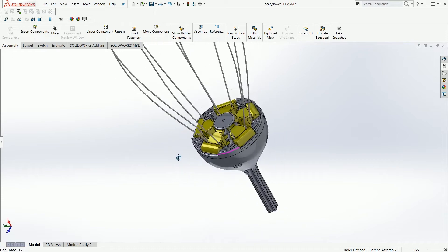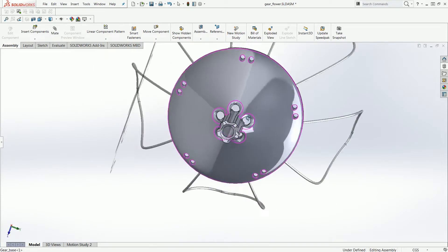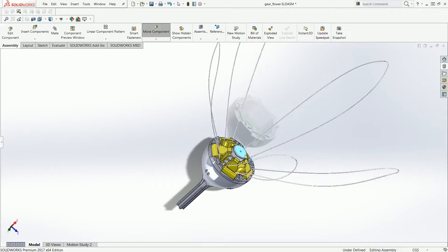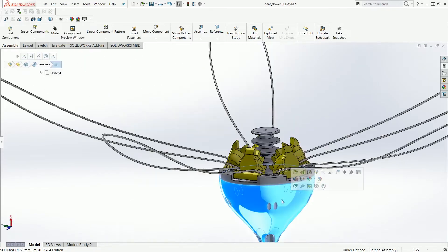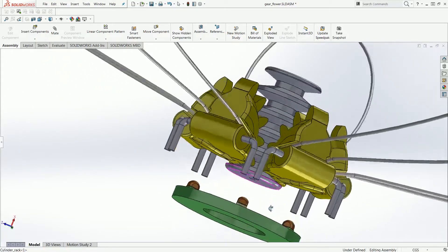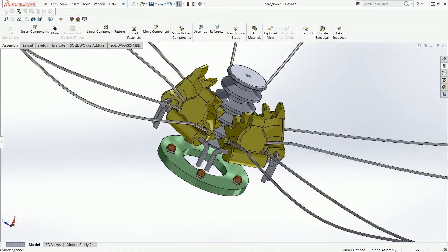The design language I chose for this project is 3D printing and simple wire forms. I wanted to be able to prototype it quickly and easily without spending a lot of money, yet have a design that could translate into volume production if we found a customer for these beautiful things. The 3D printed parts can easily be transformed into injection molded plastic parts, and the wire forms are dirt cheap in quantity.